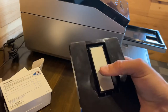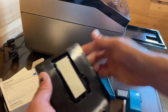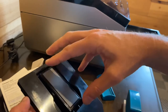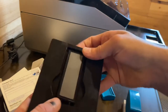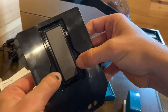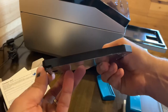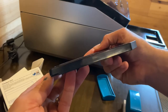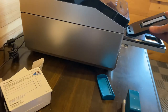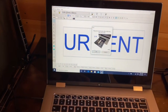I'm going to use the cartridge labeled Q18 — that's very important. There's a very sticky surface here that you don't really want to touch. That is the surface you're going to attach the die to, so I'll place this down, make sure it's really on there well and flush with the edge of the cartridge. We're going to insert that into the tray — you can only put it in one way — and then click that we are okay to proceed.